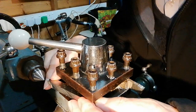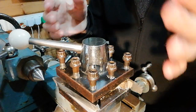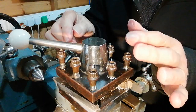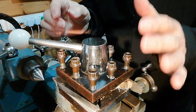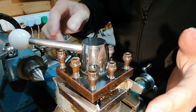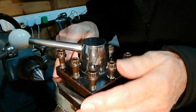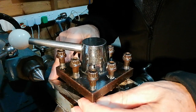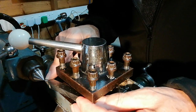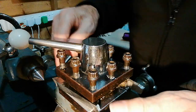Now when you're setting the tools, it doesn't matter if you're slightly out a little bit — slightly above, maybe slightly below — for most things it doesn't matter. When I say slightly, you can get it within a few thousandths of an inch by visual inspection of the cutting edge and the point of the dead centre. You'll be surprised how accurate you can get. So I'm happy that that is okay.